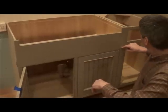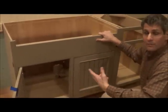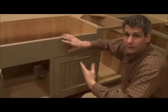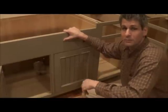When we get the sink installed, we're going to notch it down to nine and a quarter inches so the sink slides in nice and clean. If you have a bigger sink — some can get as big as ten or ten and a half inches — we can do a custom front frame where the doors get shorter and the head rail gets bigger. Just make sure you don't use a standard apron sink base; we'd have to do that one custom.